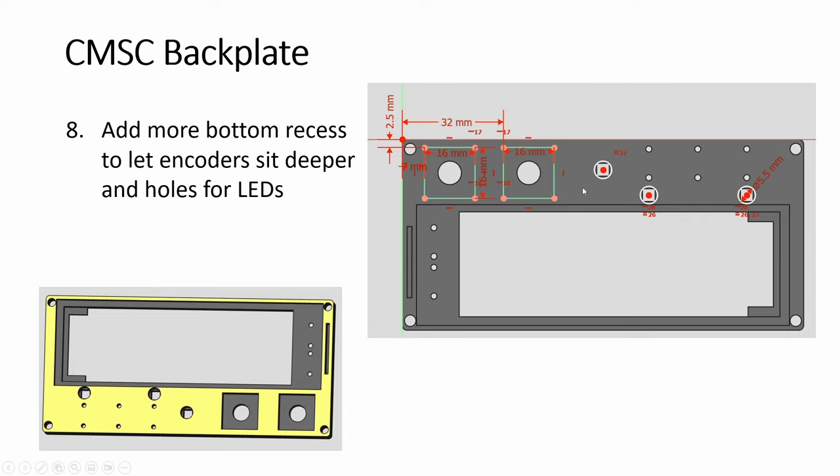I also recessed in the front — the holes are square, but at the back I have round recesses for the LEDs, the elongated long LEDs. Protrude — recess it until it almost doesn't cut through the square, but just 1-2mm behind. Then this is the top panel — you have to align the position exactly the same as the bottom. I think 10mm kind of works, but maybe you can make it slightly bigger to 10.1 or 10.2 because sometimes the button gets a bit stuck.